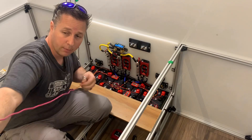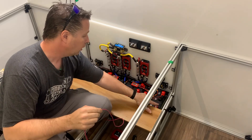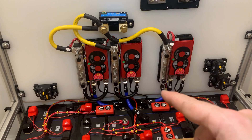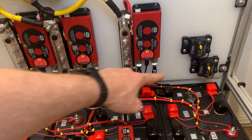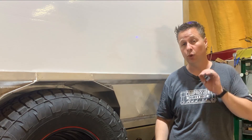With the first length marked out in full I know this is about 3 feet of wire. Now I can check using the same end mark if I can get from this terminal to the breaker to the bus bar — and from this terminal to the breaker to the bus bar — using the same amount of wire. There are three possible outcomes: one, it's exactly the same, which is perfect; two, it's too short; three, it's too long. If it's too short I can lengthen all three cables. If it's too long I can play with the routing or change the radius around the corners. Keep in mind it's the total length that matters, not the individual segments — the total cable length from the positive post to the bus bar will be the same. Using this smaller gauge scrap wire I've determined that 36 inches is almost perfect for all three of those runs.